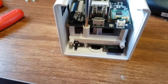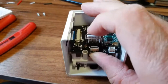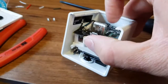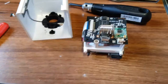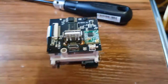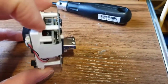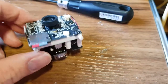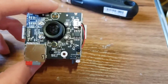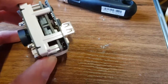Down in this pillar there is a screw, and if you undo that the whole assembly should lift out. That screw is undone — I also need to disconnect the Wi-Fi cable. Doing that, giving it a wiggle and disconnecting the Wi-Fi lead, and it all comes off. You're left with this module, with a ribbon cable going to the front where we have the camera, IR LEDs, and SD card reader.